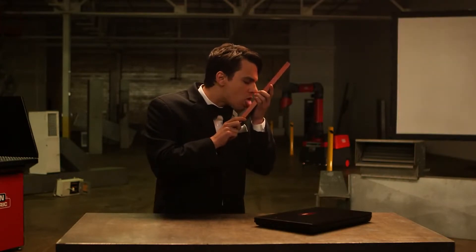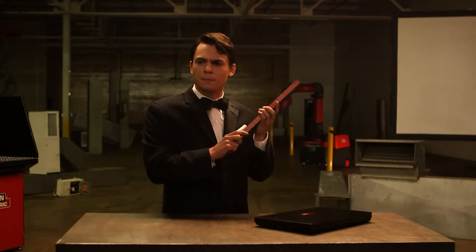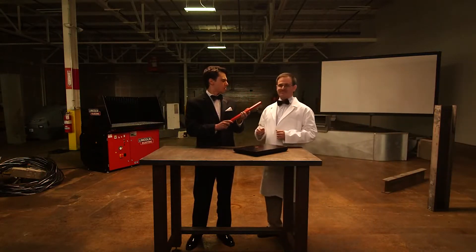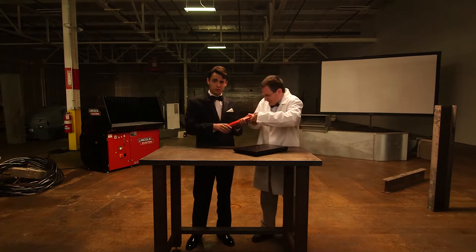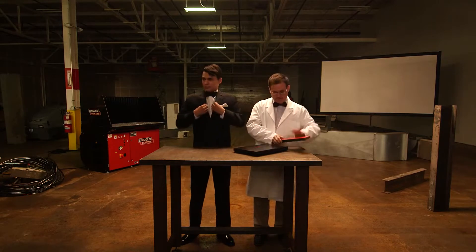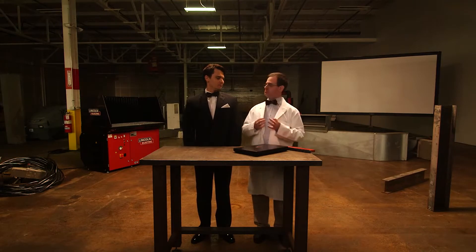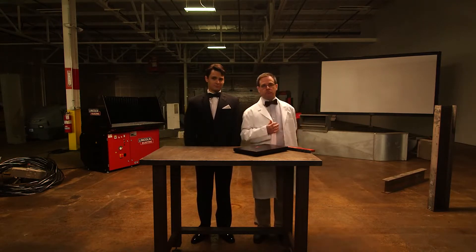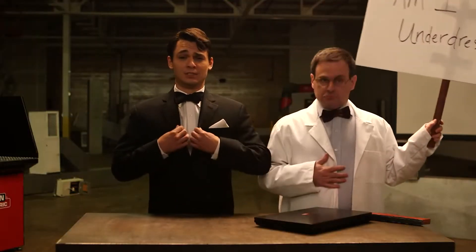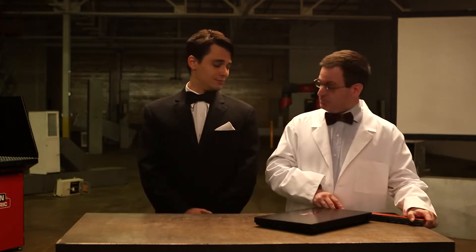...it's time to call on science. David, please don't do that. This is Dr. Science. Really, that's what we're going to call this guy? Anyway, have the base metal evaluated and the fumes sampled and analyzed by an industrial hygienist to determine what compounds are in the fumes and to measure the amount of exposure to those compounds. We'll talk more in the next chapter about how an industrial hygienist works.